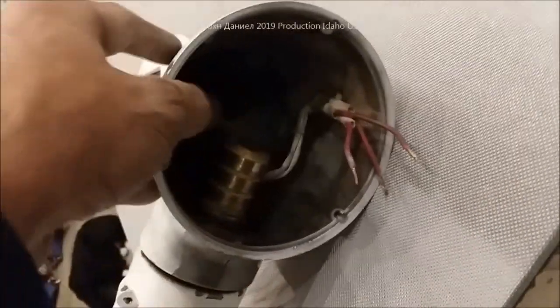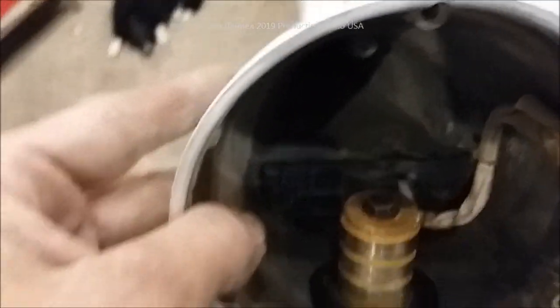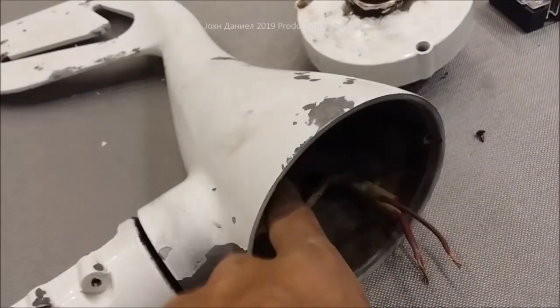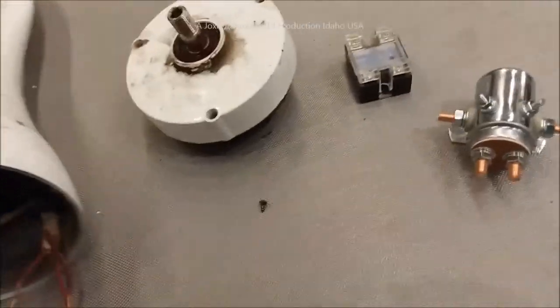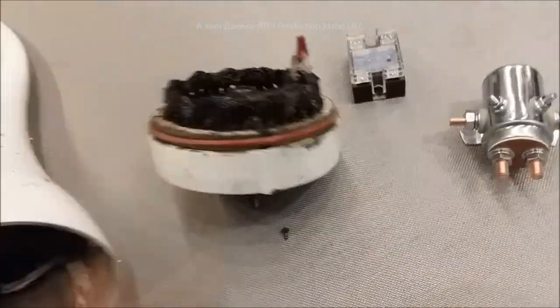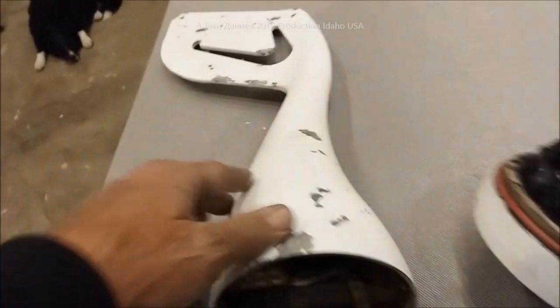I took inside here and cleaned up the slip ring. If you guys don't know what this is, that's a slip ring. It's got brushes in the back — a set of brushes back there — and that allows this turbine to turn and still send the power down through the pipe. In this one's case, this little turbine is like a 300-watt turbine. It probably produced 300 watts in a good windstorm. It's pretty beat up.